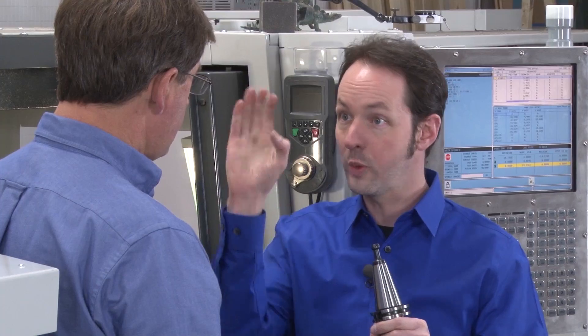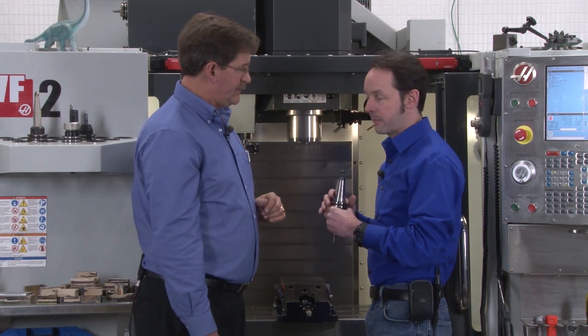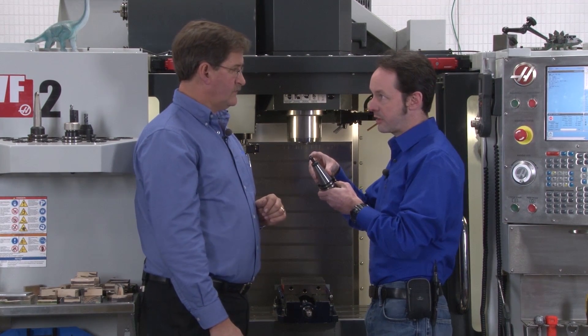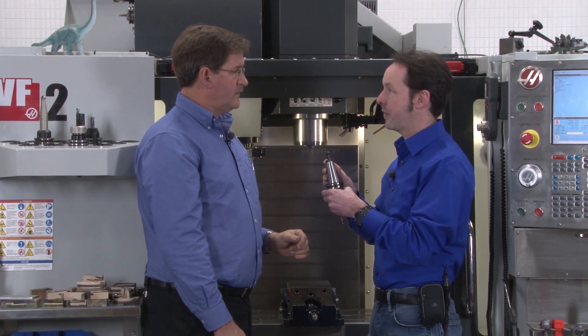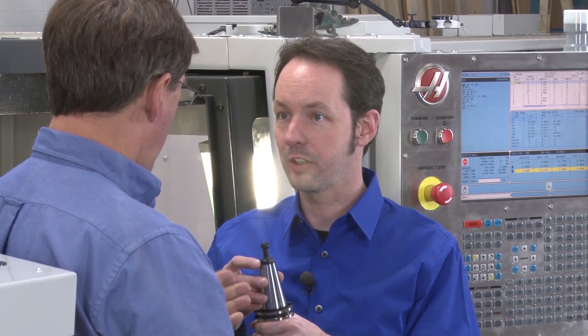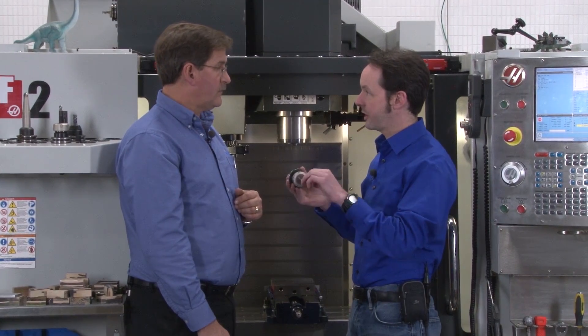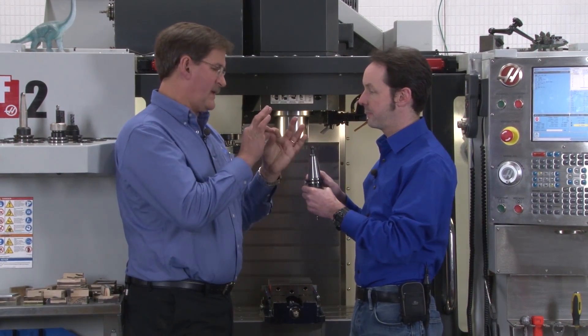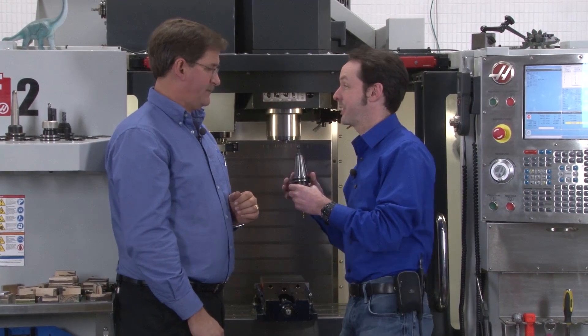They even make a squeegee tool you can use to go up into the spindle and clean it out. There's also a hole in the end of this holder — that's through-spindle coolant. We can pump coolant through the spindle, down through here, and onto the tool at high pressure — anywhere from 30 PSI for a stock setup to 300, 1,000, even 2,000 PSI. ISCAR actually makes a drill that's 93 thousandths in diameter with through-coolant holes in it.